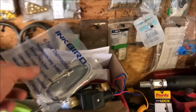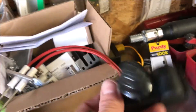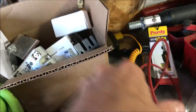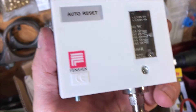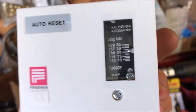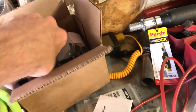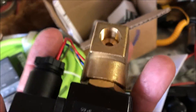My next move is to open up all this greatness. I'm gonna have two solenoid valves in this thing. Got an igniter, got a solid state relay, got a real nice Fention control module - that's my pressure switch. Got an Inkbird PID that's going to be our temperature switch. So we're going to have a solenoid for the pressure cut-off for the fuel and a separate solenoid for the temperature cut-off for the fuel.